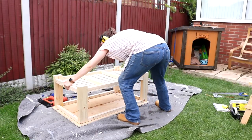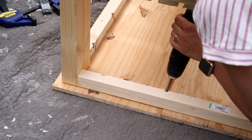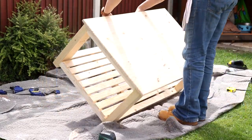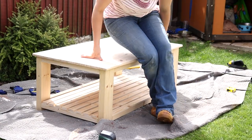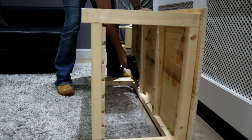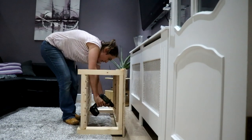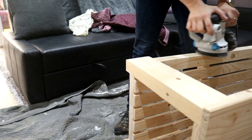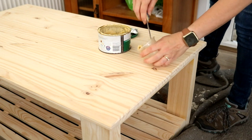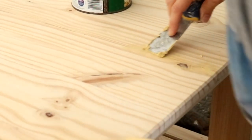Then I placed everything upside down so I could finally attach the base to the top, but I didn't bother with glue for this. Naturally I wanted to do a sit-down test — that didn't sound good. I realised I needed some more battens there as well, particularly because mine's got a join. Once I was happy with the structure I sanded the whole piece — any protrusions, the joins, any overhanging slats. Because I wasn't totally happy with the join being visible on the top, I mixed some wood filler and went over the joins and any knots that had chunks missing.